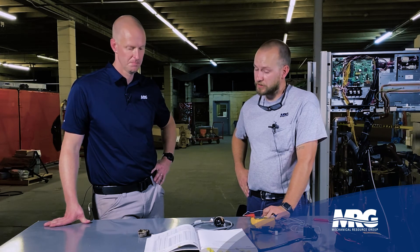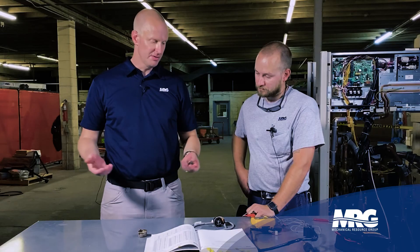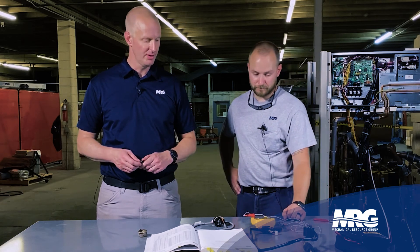With a half dozen or more electronic expansion valves on a Daikin system, one bad EEV can cause refrigerant flood back — especially if the sub-cooling circuit is stuck open, flooding liquid refrigerant straight to the compressor. You'll trash your compressor very quickly. Compressor failure is generally a symptom of something else. These compressors are very robust, so if you have failures, trace it back — most of the time it leads to an EEV that hasn't been serviced. VRV is awesome technology; you just have to figure it out. Hit like, subscribe, and we'll see you next time.